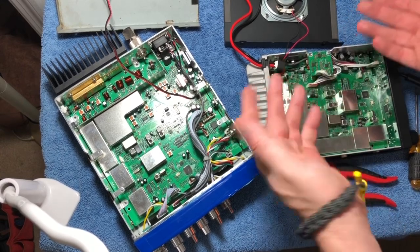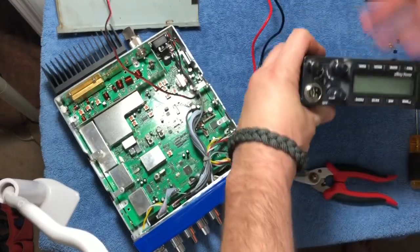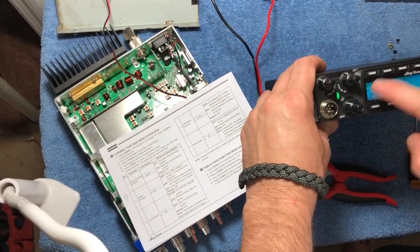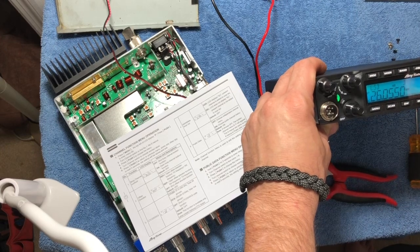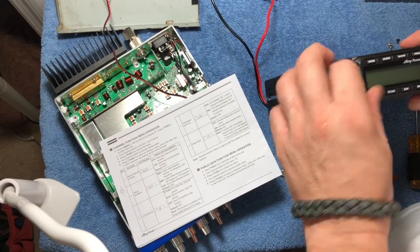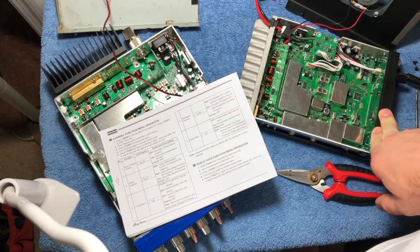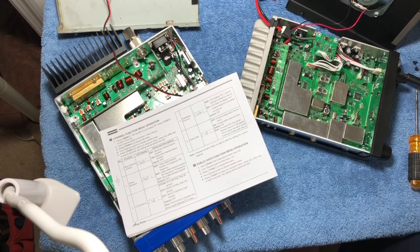Not that it has a performance issue or difference, but just to keep things tidy inside the radio. So we go ahead and try it real quick — using the same instructions. We turn it on, hit menu, F, push: busy, repeater, tone, squelch, transmit — so TSQ — we had that on the last one. Yeah, this board will work. So if you bought your radio without any tone board, you can go ahead and get this one put in, and you'll be more than happy to see that the tone board functions.